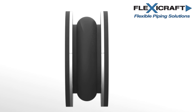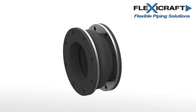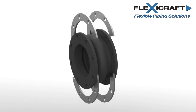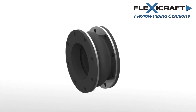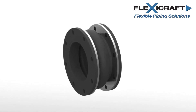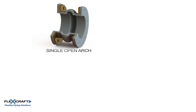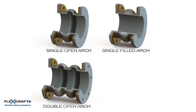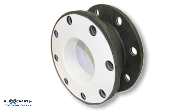Spools, such as the FlexiCraft Ultraspools, have a robust design with full rubber-faced flanges that make an excellent seal against the mating flanges. The metal flange backing rings, also called retaining rings, are split and easily removable. The rings are normally galvanized carbon steel, but are available in 304 or 316 stainless steel as well. Like the sphere's metal flanges, the metal retaining rings do not come into contact with the fluid. The spools have half-circle arches that can be filled to provide a smooth bore, or additional arches can be added for greater movements. Integral PTFE liners are also available that conform to the spool's arch, which can be important for highly aggressive chemicals.